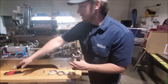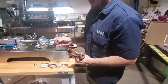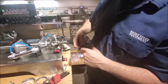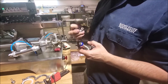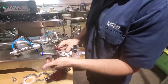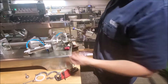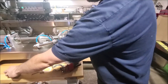We'll use a five millimeter Allen wrench. There's our gasket — that's what's keeping it from leaking. That's about all the further you need to take it apart for a thorough cleaning. As you can see, this is greased pretty well. Any of these points with this piston and our main piston, we'll want to add a little bit of grease when we put it back together.